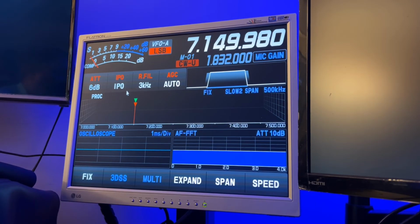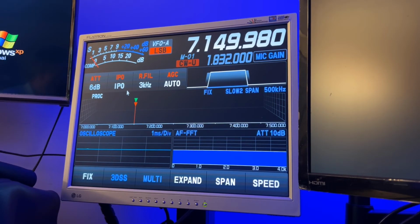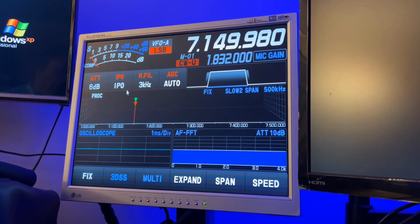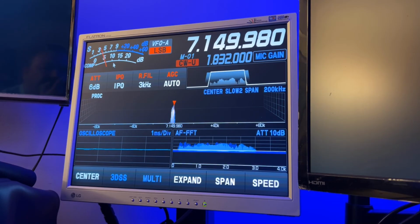And guitars use compressors, bass guitars, electric guitars. They're even used with vocals. So the idea is the compressor means I'm going to let you reach a certain level, and then I'm going to compress it. I'm going to hold it there. Watch that comp screen up there, and what you want to be at is about 10 dB of compression. So we want to be somewhere along in there, okay? And honestly, if you're bouncing along a little below 10 and once in a while a little above 10, that's fine.